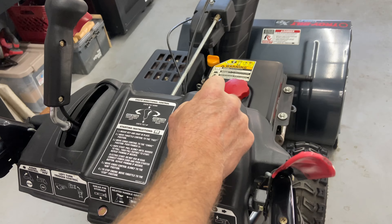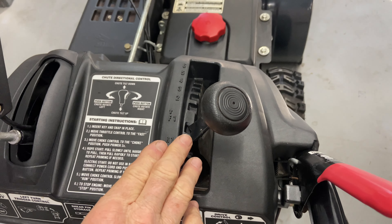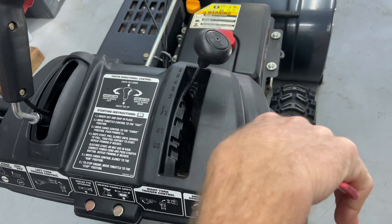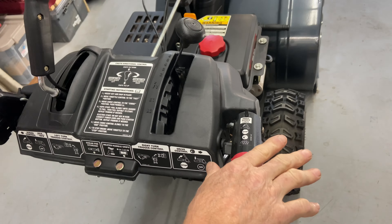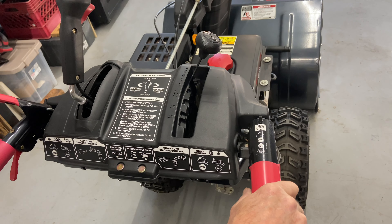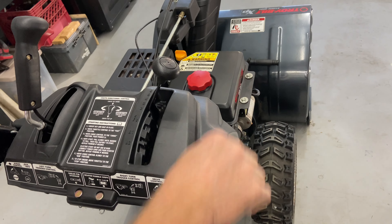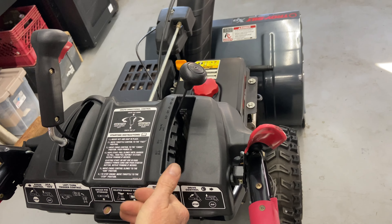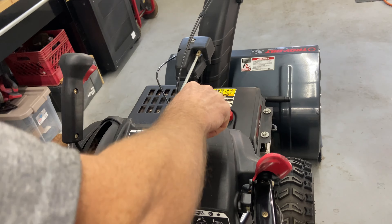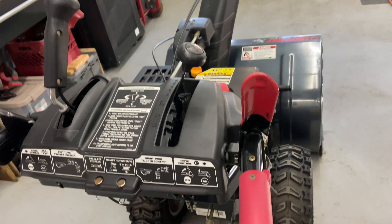This right here is your forward and reverse speeds. In my opinion, it's easier to do all your gear changing when your auger lock handle is not engaged. When you press down on that handle you're pressing a rubber disc against a metal disc that's turning, so you won't be able to move the gear lever easily. Get into position before engaging — if going in reverse, shift all the way back, then hit the handle.